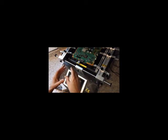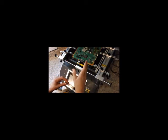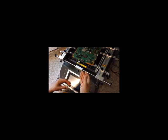And then our board sensor is going to sense our board temperature so that we know our board isn't getting excessive heat where we're going to damage other components on the board. And then our upper probe is going to actually monitor the chip, and once we get into our reflow range or our liquefaction range for leaded or unleaded, whatever we're using, whatever profile we have, we'll be able to sense that. We can run our duration we want in that zone, and then the unit can be powered down and cooled down. So it's very easy then to take your probe off and just tape it off to the side. Your probes aren't in your way. You can lift your board up, take your board out of the way.